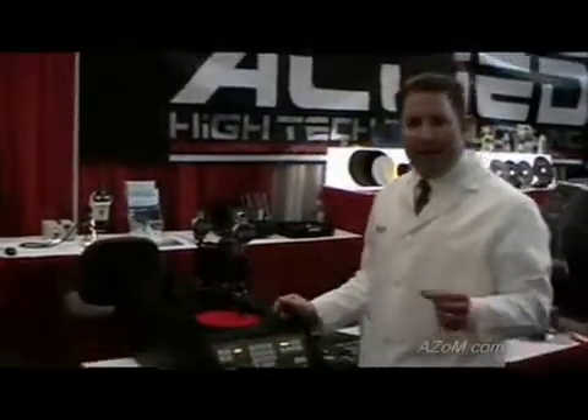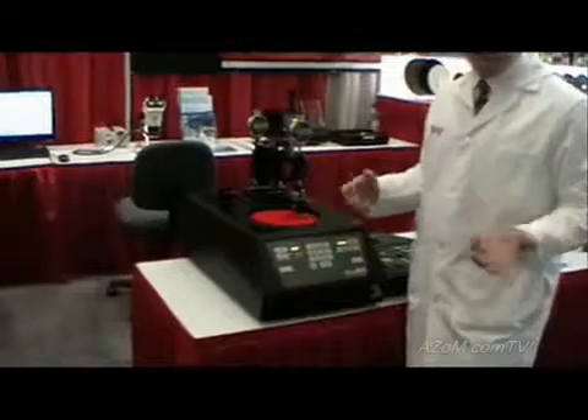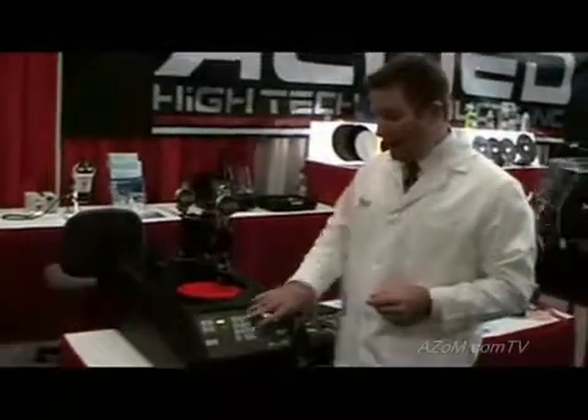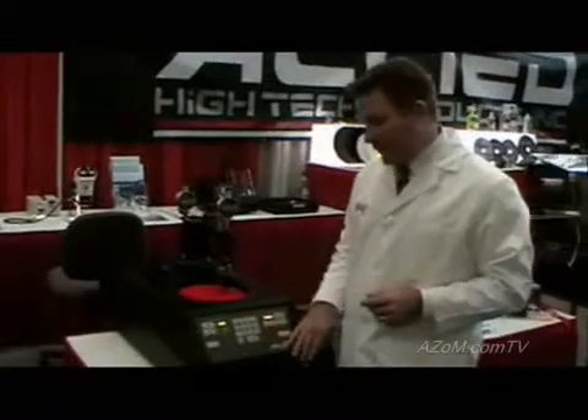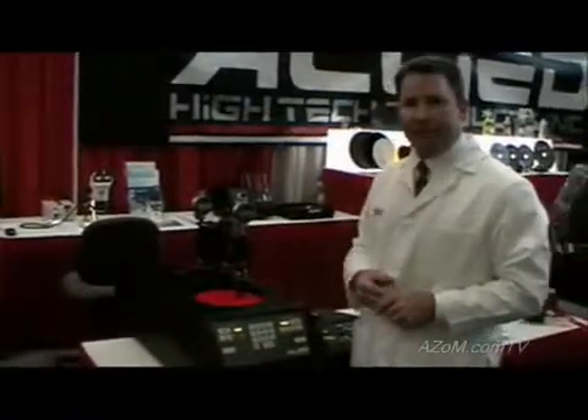A load attachment on the side of the instrument helps accommodate many different size samples. As the surface areas of samples vary, the pressure must remain constant, so as samples get smaller the load must be reduced to reduce the pressure. The base is a variable speed polishing machine, similar to a metallurgical grinding machine but with machining tolerances not found in ordinary metallurgical grinding machines. Variable speed is entered via a keypad, and a coolant button activates coolant flow onto the abrasive surface. That concludes the demonstration — thank you.